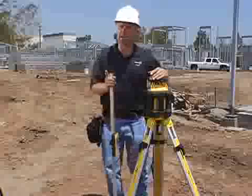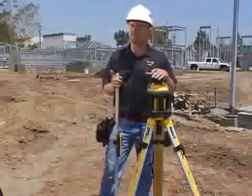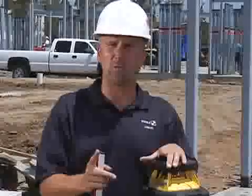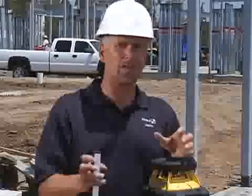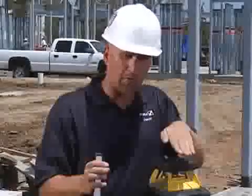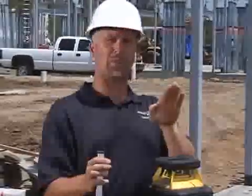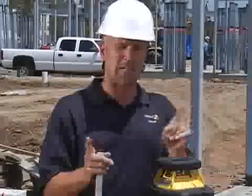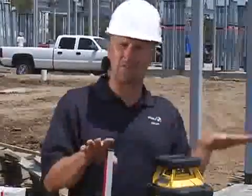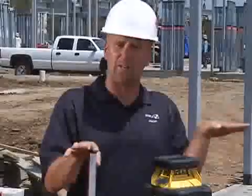Earlier when we were in that commercial job site and I was showing you the LAR250 that does horizontal and vertical, I also told you that it does one more thing. It does slope. And we call it simple slope, and what we mean by that is our laser will slope in one direction, down 5 degrees, or up in that same direction 5 degrees. And the simple part means it stays in that axis. And the opposite axis, the laser's always still going to level.